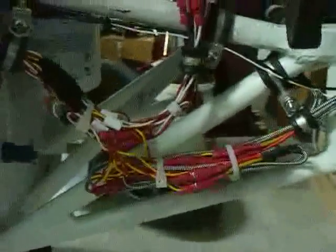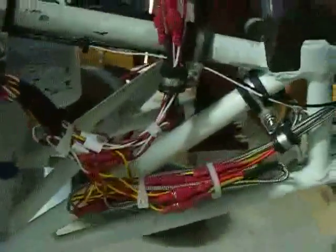Here's the MSD coil switch, which is just a couple of diodes in there — glorified. There's the through-fittings — this is for all the EGT. You can see there's a big mess of wires for all the sensors: EGT, CHT, and all that — they're all AN-clamped on. The exhaust log comes out here; I have to get another bracket that goes on here, and the exhaust — the dual one on each side — comes out the side of the cowling.